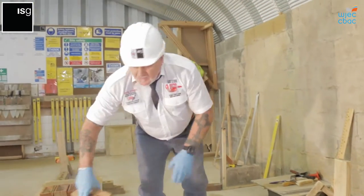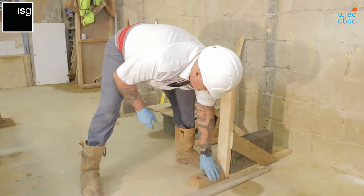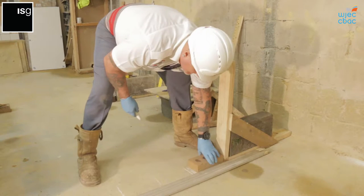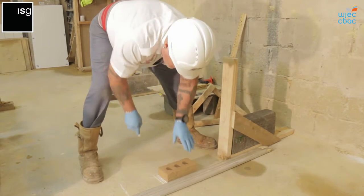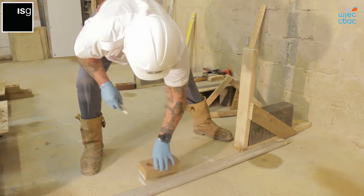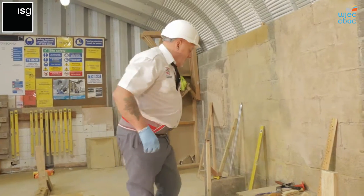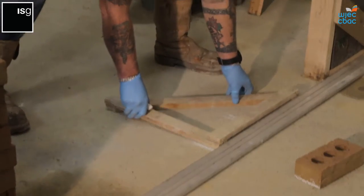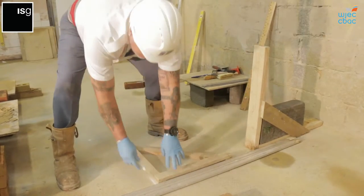Then, for this quoin, we need three full bricks from the door frame. So we place a brick there, strike a line, allow 10mm for a joint. Then put another brick, 10mm for a joint, and then your final brick. What we do then, we know we're three bricks out because there were three bricks damaged on the quoin on Sunnycove Lodge. Then we use a square which goes against the straight edge. So you know that's the end of your wall, that's your three full bricks coming out. Strike a line.